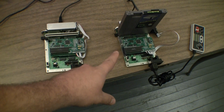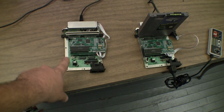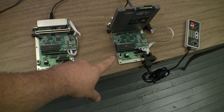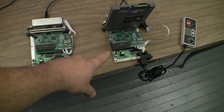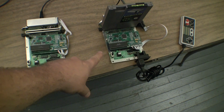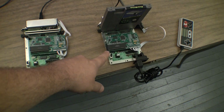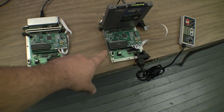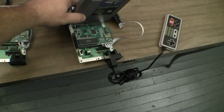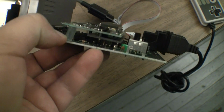Here I'm running a different top loader altogether. This is Sam's with Tim's adapter board, and this is for a different customer, and I had already pre-made it a while back, and the project was on pause because I haven't heard from the customer and I had some questions. But it has my adapter PCB in it. It does not have the clock trace bypass or anything like that. What I did do was remove that transistor. I don't know if you can really see down in there, but it is gone.